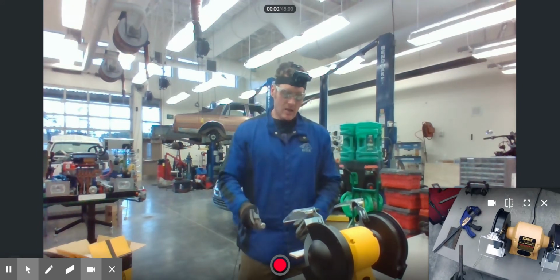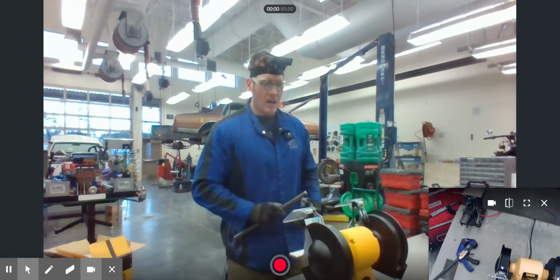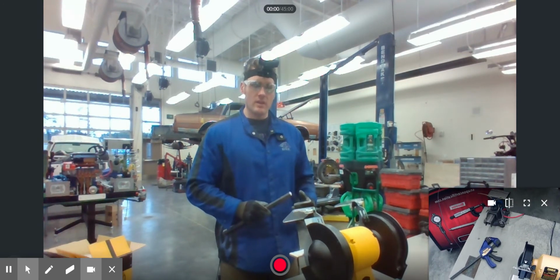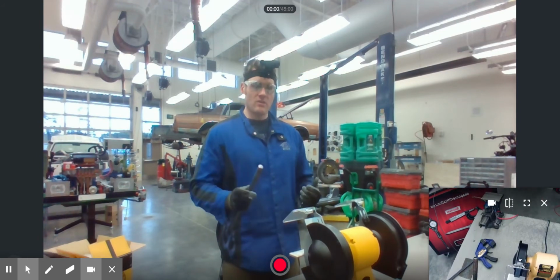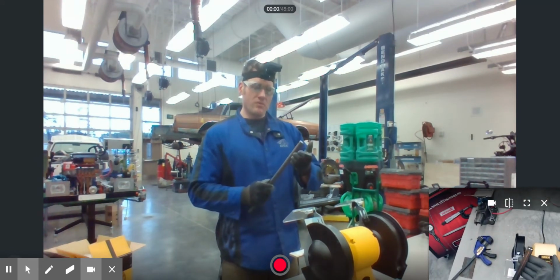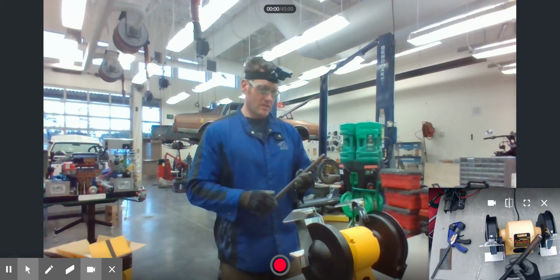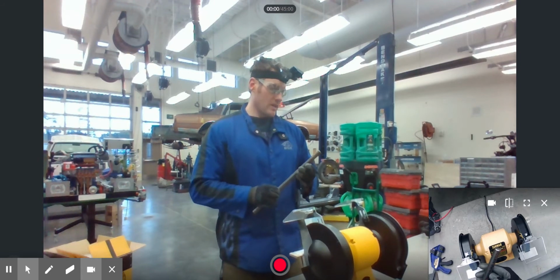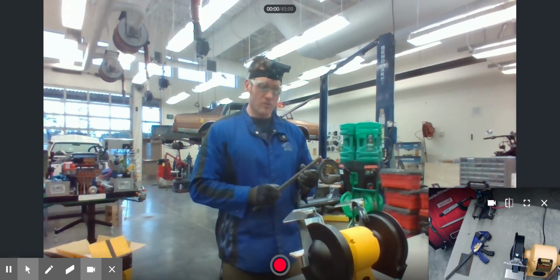Okay. When you're all done, if it is hot, it does help to cool this thing off in some water. So if we have a cooling tank available, make sure you cool off the workpiece in the cooling tank before you handle it, because as you notice, the heat's going to gradually move through the entire workpiece, and eventually it's going to get to the point where the workpiece is so hot that you don't want to handle it anymore. So make sure that this thing is nice and cool before you go to handle it with your bare hands.